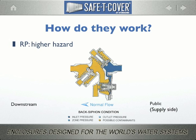Now, consider a full failure of the number 2 check valve. Now you have water flowing through the relief valve at head pressure. Again, if this is a large or multi-story building, that's a lot of water very fast. Finally, consider a failure of both check valves. In that event, water will flow at a pressure higher than the supplied pressure because you have to add the head pressure to the supplied pressure. And this water will flow until those valves are manually closed.